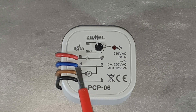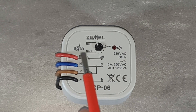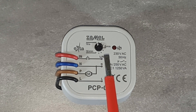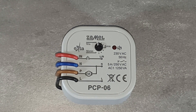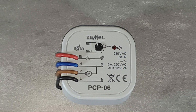N, the blue wire, is for connecting the neutral signal of the power supply, connected to the N neutral wire. In, the red wire, is for connecting the light switch; it should be connected in parallel together with the bathroom lighting. On the front panel is the rotary potentiometer for setting the fan operation time in the range from 10 seconds to 16 minutes. Next to it is an LED indicating the relay's operating status. Installation is facilitated by laser printing with the connection scheme as well as the basic parameters.